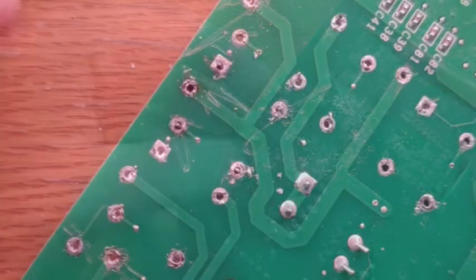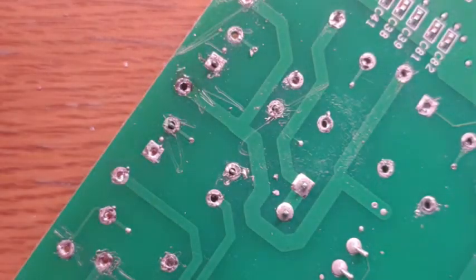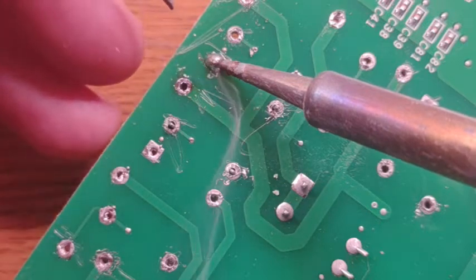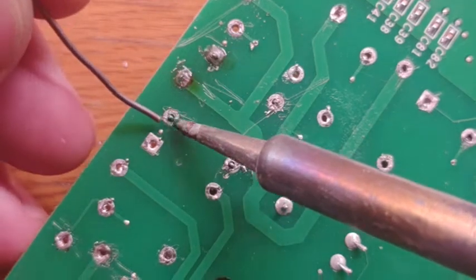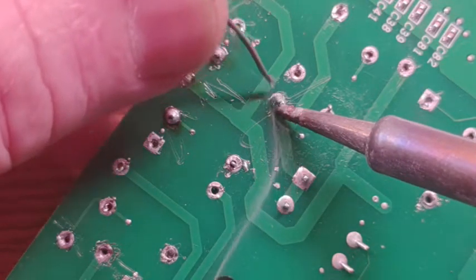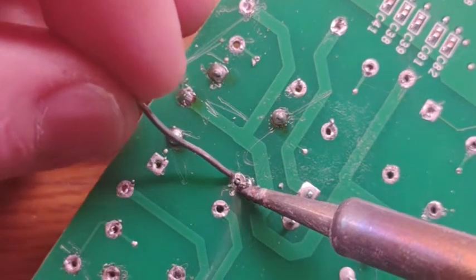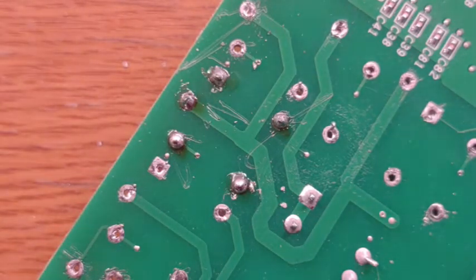There's all my pins through. So using that same concept, all the pins that are on your relay — just go through and add solder to each of those. Just hold still for a second while they solidify, and that relay is done.